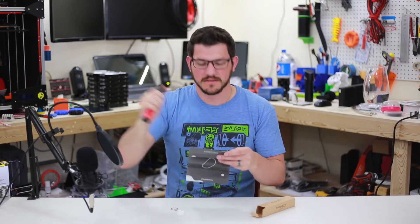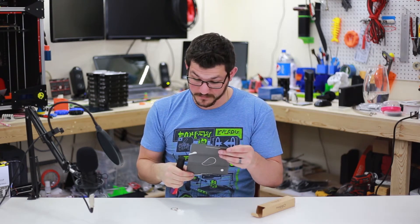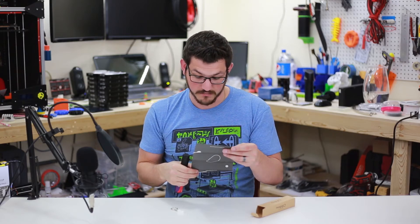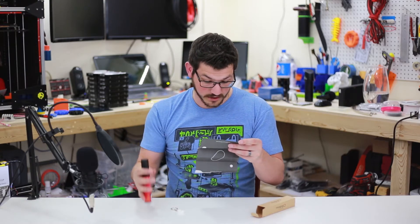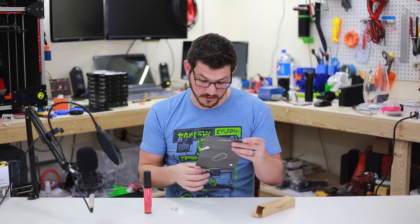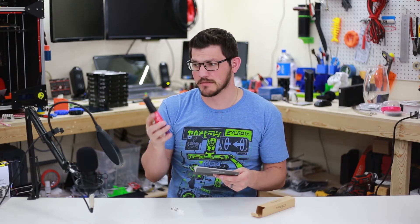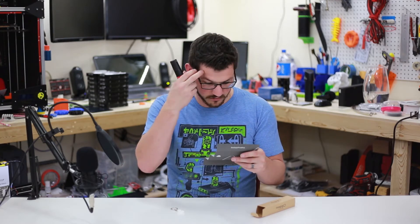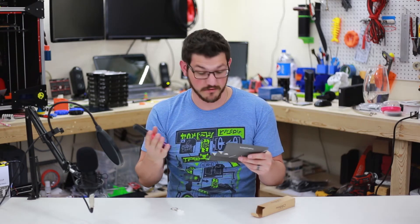There's a little thing in there to help it go. Press the nib end of your pen on the print bed for Magigoo to flow. Spread the adhesive evenly on the print area — cover your bed with an even thin layer and make sure no spots are missed. It's best to apply Magigoo when it's still cold. Store it upright. It was specifically done for mobility — take it on the go or even on a flight as hand luggage. It gives you recommended print settings: build plate 40 to 60 for PLA, 90 to 110 for ABS.